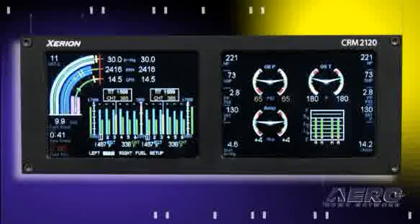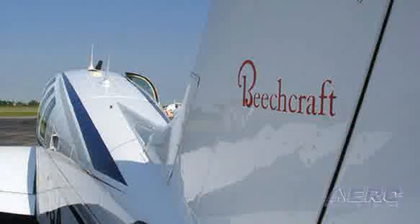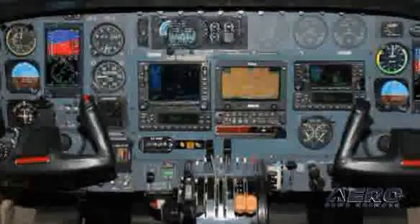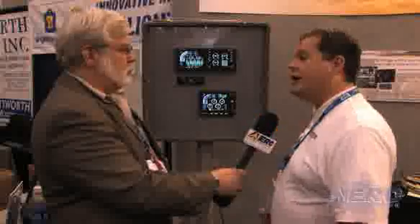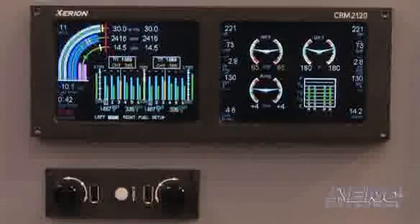The feature set is all-inclusive. This system will allow you to replace all of your primary engine instrumentation, including fuel quantity, in most of the twin engine fleet here in the United States, targeted at the Cessna series as well as the Beechcraft Baron. What you're getting here is the ability to replace your primary RPM, manifold pressure, and fuel flow, as well as exhaust gas and cylinder head temperature. Full-featured fuel computer here. And along the right-hand side, you see a very crisp, clean display — very easy to read — for oil pressure, oil temperature, a dual ammeter, and a nice fuel quantity display. We've got digital indications for horsepower and percent horsepower, of course computed for you, as well as fuel pressure and your volts for electrical system monitoring.